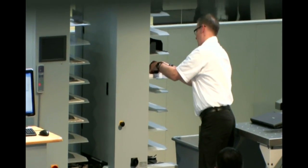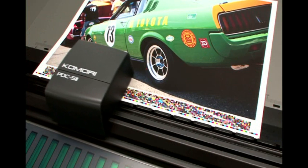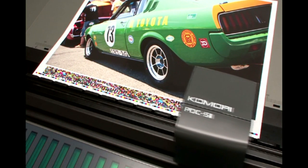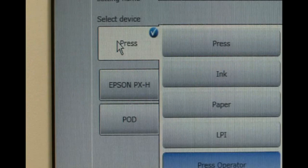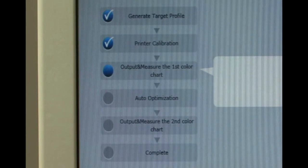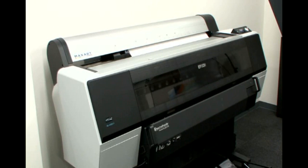And in our DoNet Zone, you can see exactly how it all operates. Okay, on the screen, we're going to demonstrate a simple color matching setup on the assumption that the colors on the inkjet proof and the Lithrone didn't match. So first, the color chart is printed together with any image at standard density in the margin of the sheet. And then the same image, including the chart, is output from the POD machine. And the colors on both sheets are measured with a PDC.